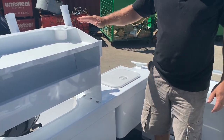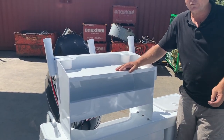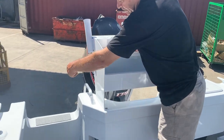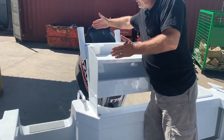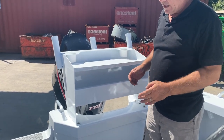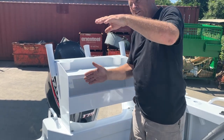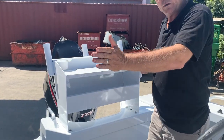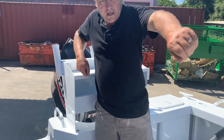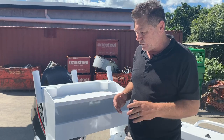One of the things I think you'll find most unique about our boats is the amount of internal space. We achieve that because it's 850 millimetres from the back of the boat to where the engine sits — that setback means more usable room inside. If you pay attention to other boats, you'll see that to save construction cost some manufacturers just do simple folds, but then the engine has nowhere to trim so they have to move it forward into the usable space. Run a tape from the back to the front of this boat and you'll see there's a lot more space in here — and in a rear mount, that's critical.